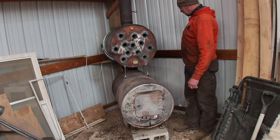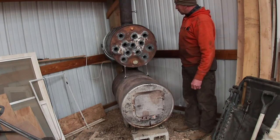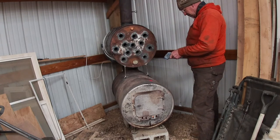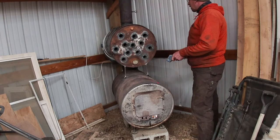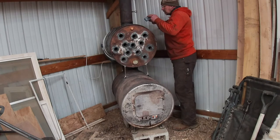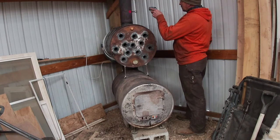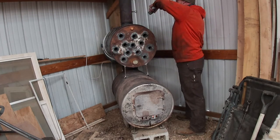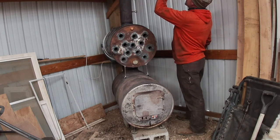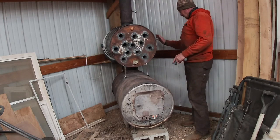But I'm gonna grab my temperature gun and then I'll turn the fan on after I get a couple readings. All right, let's see. Top of the stove, 488, 491. Not up there, 400. Chimney's 450. When we go through the roof, we're up to about 250 going through the roof up there. So it's hot. I mean, it's real hot.